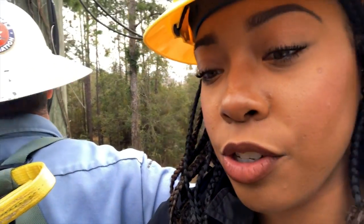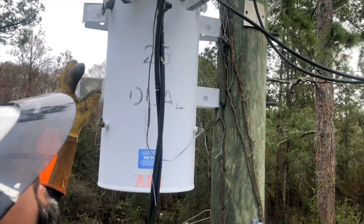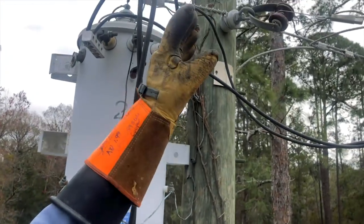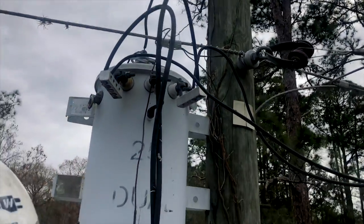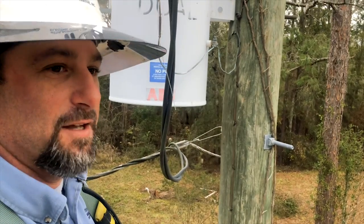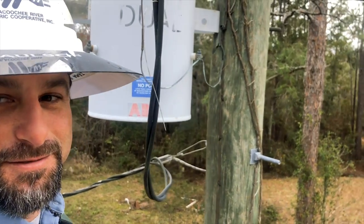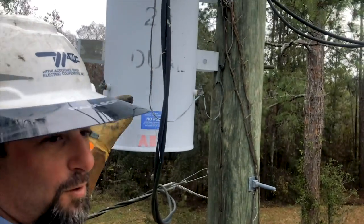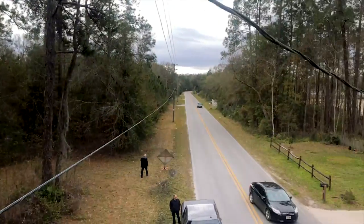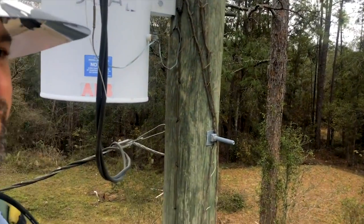We're gonna flip the camera around to show Sal. Everything above us is energized. So those lines up there, there's gonna be 14,000 volts. And then it comes down and hits a transformer, which transforms that voltage into what you can use in the house, which is 120, 120, 240. That's a big difference. So we go through a bunch of coils and this will be your service wire going to your home, like that. That's how you get power.